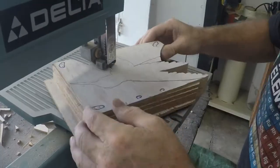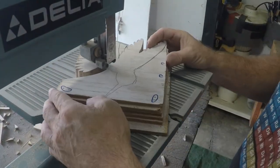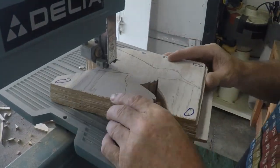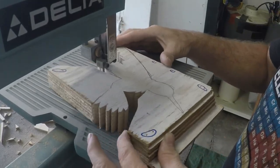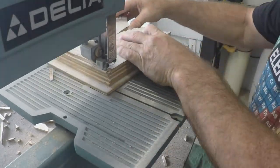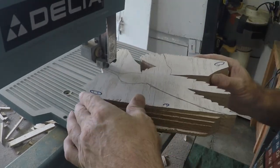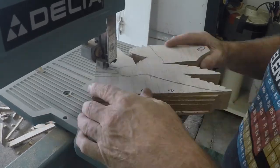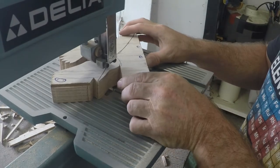You can see here this tight area got a little tricky. That's easily fixed by pulling out a bigger sliver of wood. Notice all the brad nails are still in place. To go around the sharp bend of the bird's head, make a lot of small cuts so the pieces of wood pop out as you're trying to go around the corner. That keeps your blade from binding.